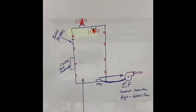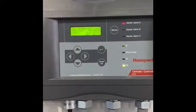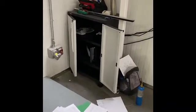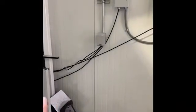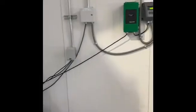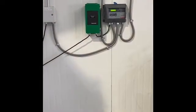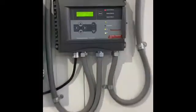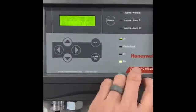Let's go look at the system. When you walk up to this controller — it's the 301C controller on this wall — you have your power sources in there, uninterruptible power supplies. That outlet is feeding those and then it's coming back up here. That's where your horn and strobes are tied in. And then that green thing is your low voltage power supply that's feeding your gas detection system.